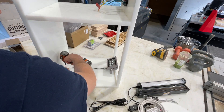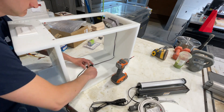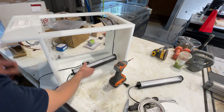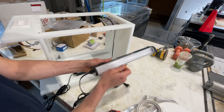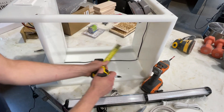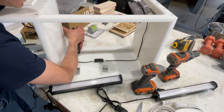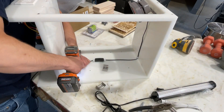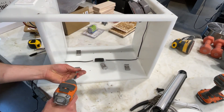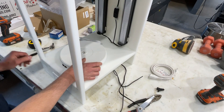Once I've mounted that light I'm using some cable ties to mount the wires to the box to keep things clean. It'll keep them out of the way of that rotating photography tray. I'm going to clip the cords with scissors because I'm going to tie all those cords into the junction box. The two linear lights are 16 inches each at 25 watts each, so there's almost 100 watts of UV curing power between these three lights - which I think is overkill. They come with little metal grip mounts and just pop into those metal components, so they're pretty easy to install.